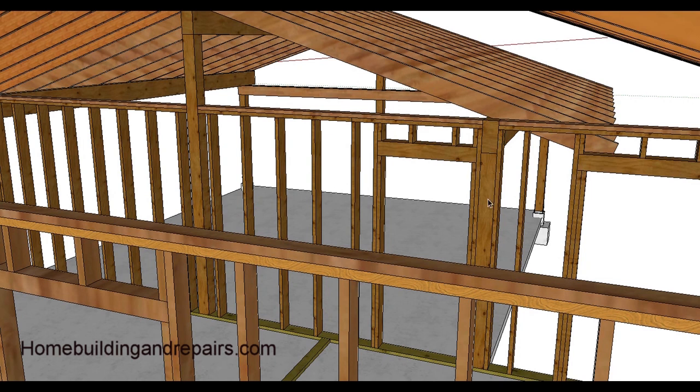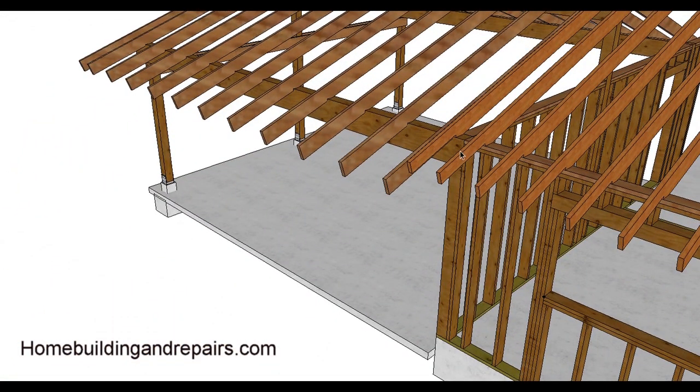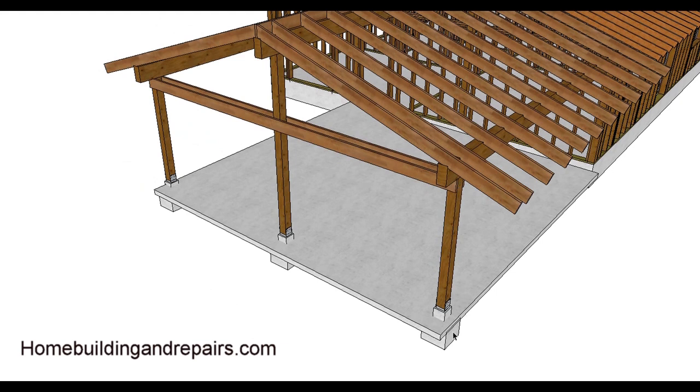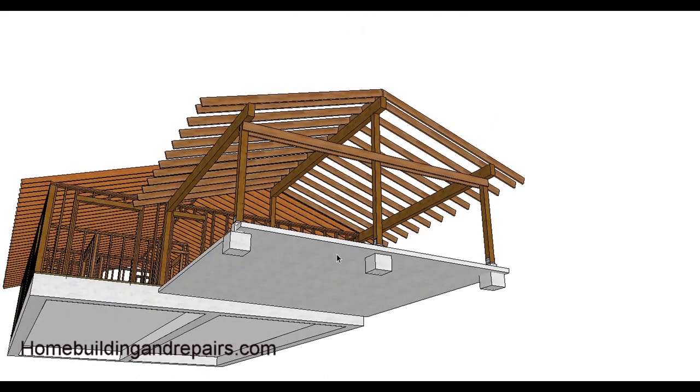Here's another view of how I think it's constructed: a beam sitting on top of a post inside a wall, same thing over here, a post supporting the ridge beam inside the wall. The other beam and post are the same as the other side. I would doubt that you actually have concrete coming up - hopefully the footings are underneath the concrete and the post is sitting on top of the slab. Most carport slabs are at an angle; let's not forget that's not a flat slab.